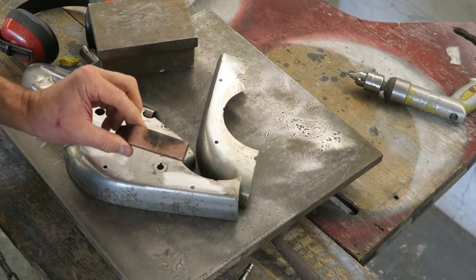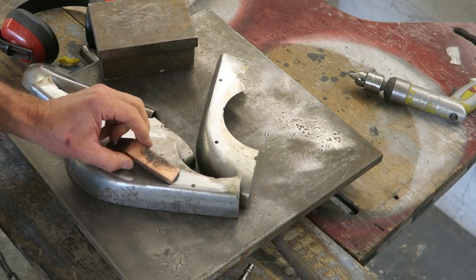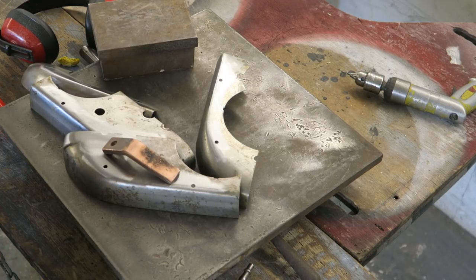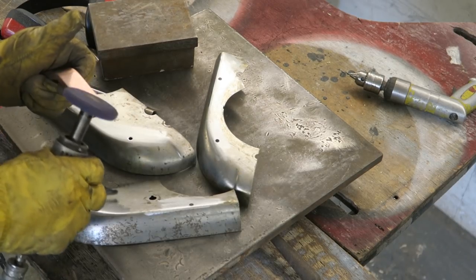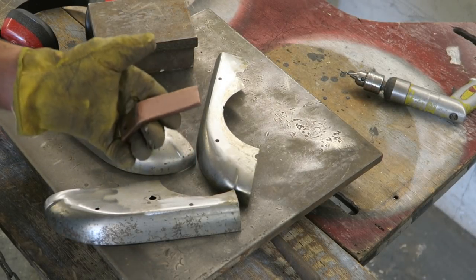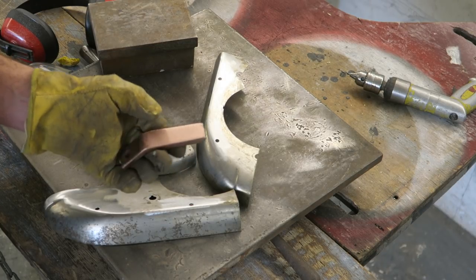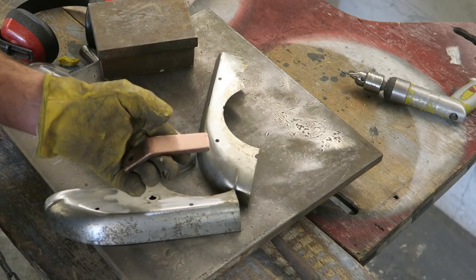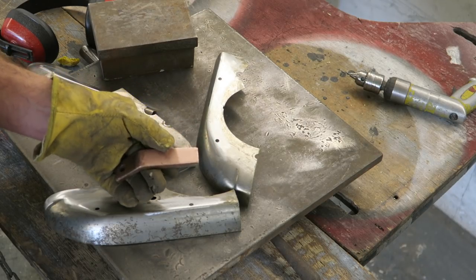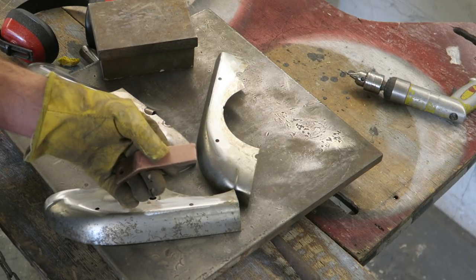Got a nice bar of copper there, quite thick, so it absorbs plenty of heat. What I do next is I'm going to give this a good clean up. I can do this with the strip and clean wheel again. Always best to get this nice and clean because the weld won't stick to it because it's copper. Don't make the mistake of thinking, oh, I'll just leave it dirty, because you actually want the welder to make good contact with this. You actually want it to be very conductive, and then you can build your weld on